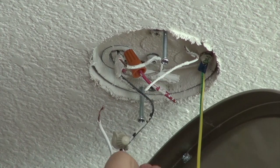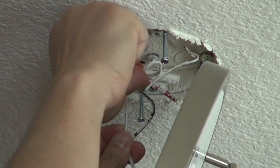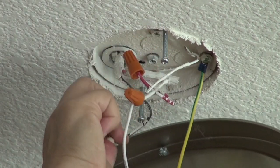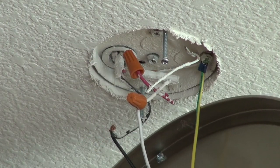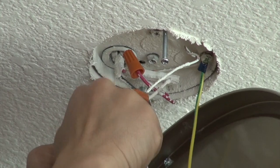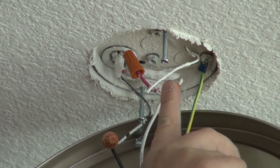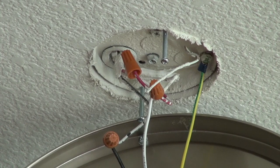The next step is connecting the return wire — the neutral wire. I'm going to tap it right like that, and then put the cap on it. I'm going to redo this using the smaller cap — it's much tighter. I can feel the nice grip on it. So again, the black goes to the black, the return is the neutral, and the neutral wire is white. The ground is already connected, and I'm not doing a fan — just the lighting fixture.